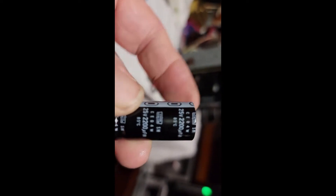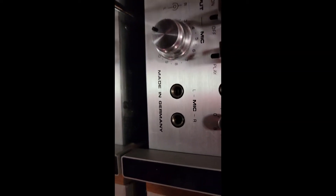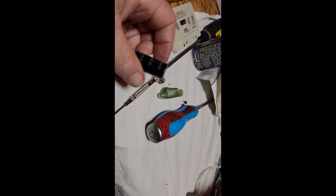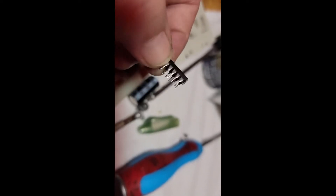The capacitors in this one are branded Nippon, so they're made in Japan. My other deck says made in Germany — I'll take a peek at that one to compare capacitors. These are definitely leaky so I'm going to restore this. Everything is working fine now except for one of the Dolby boards — the right channel IC, part number LM1011N. I found one of these from Dual in Germany, so I'm going to get the original IC and that'll fix the problem.